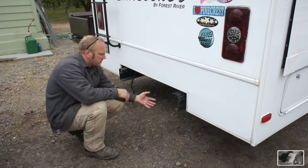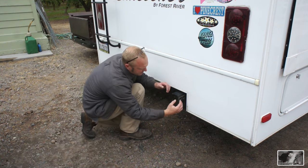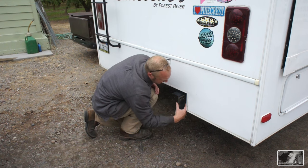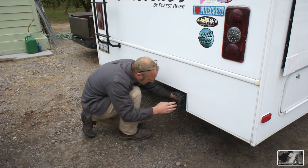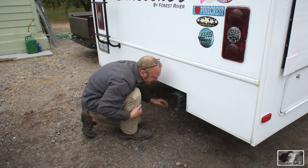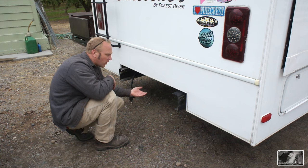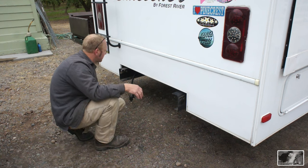So what we're gonna do is, he pulled the bumper off himself. We're gonna build some new brackets. Their brackets only came in to like right here. And we're gonna bring them to the inside of the frame rail and forward much further. And then we're gonna weld the hitch onto this heavy wall 4x4 box tubing.